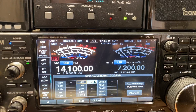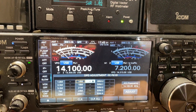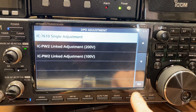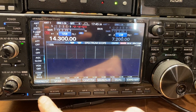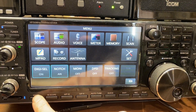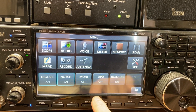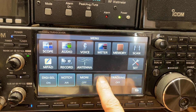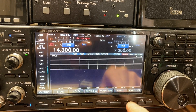That concludes the adjustment. To get out of it, you hit Exit down here — it takes you back. If we continue back and go over to the menu, you'll now see on 20 meters there's a button that says 'DPD Off.' You can click that and it'll turn it on. That's the Digital Pre-Distortion, and that's how you get it set up.